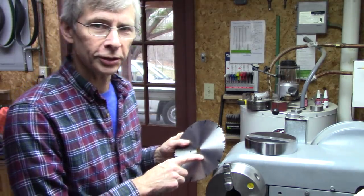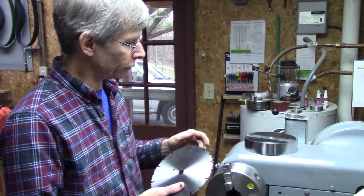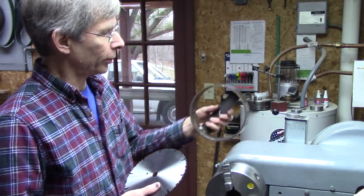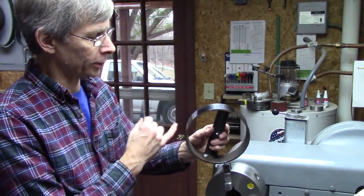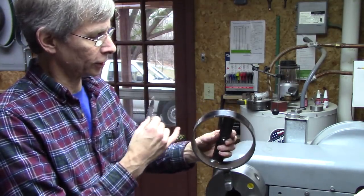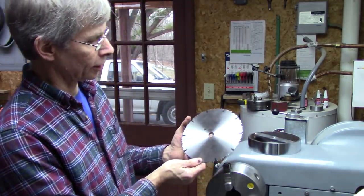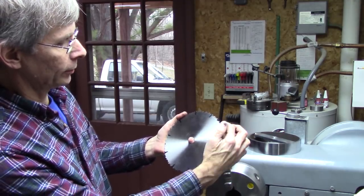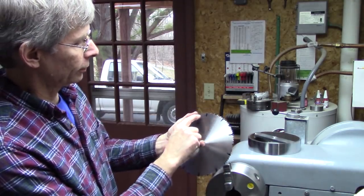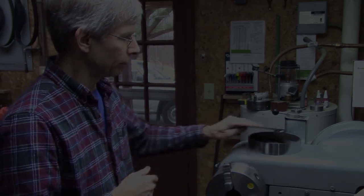I could just use this every time I need 100 teeth or 100 holes to index from. But I thought I'd make it all on one dial. And I can mark them in like fours, sixes, eights, whatever. You can see where I did the 10, every 10. There's 5. This will work pretty good for making this indexing wheel.